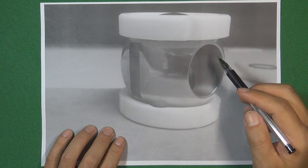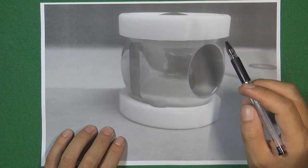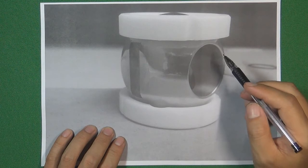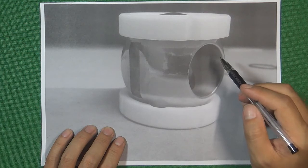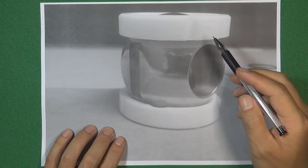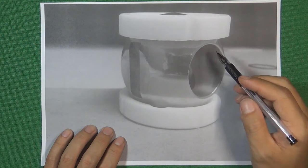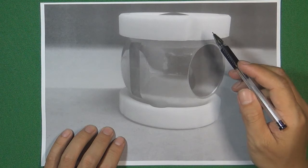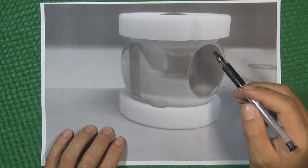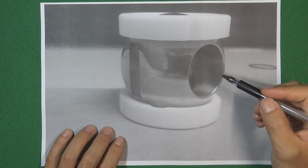But the disadvantage is that the valve seats are very soft. So if the flow media are not pure — if the flow media contains particles — the particles may scratch the valve seat and make the valve leak. So engineers are looking for another kind of material that is a little bit harder than this soft seat material, but is also an elastic material.